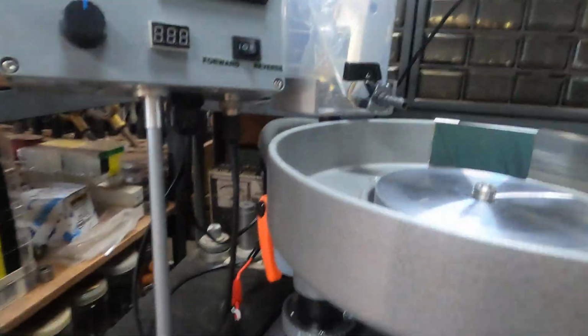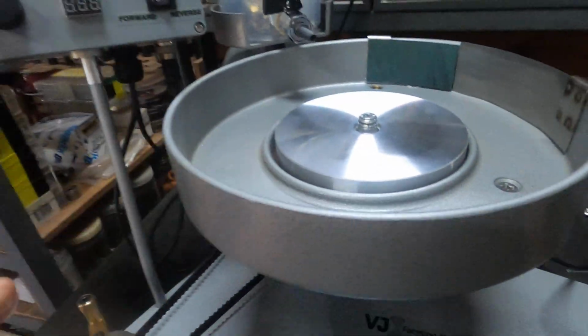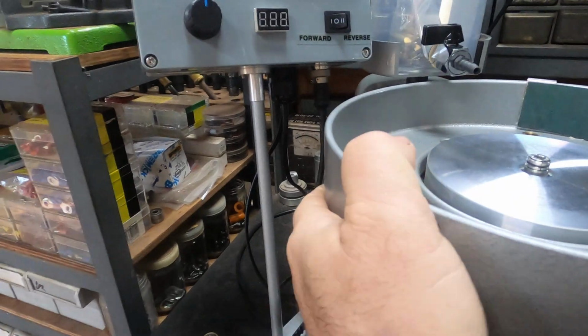So for your cutting deck, you've got a lock here on a little T-handle. Just lock that. It'll stop this moving, and you can then do your height adjustments up and down still. Need to move this, unlock that, it'll move around. Happy days.